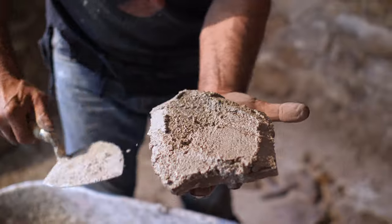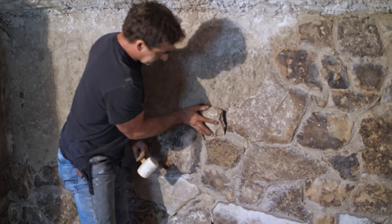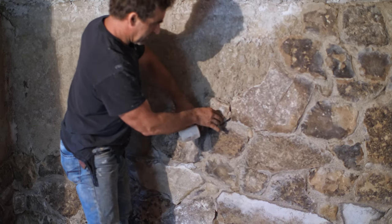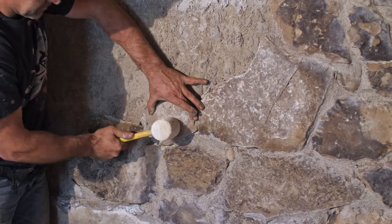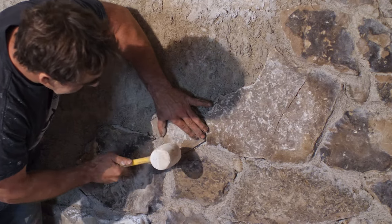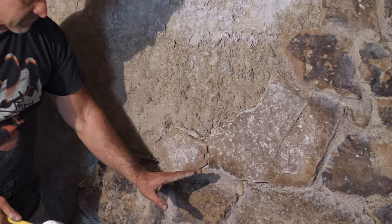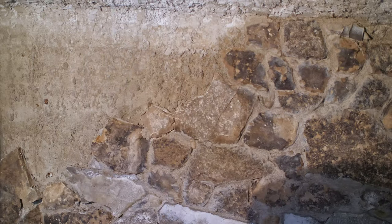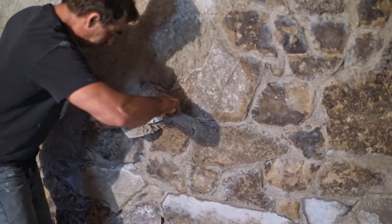In doing a lot of this now, I've come to realize with experience about what I need to put on. Get it on the wall there, and then with a rubber mallet just tap it into place and the mortar should start leaking out the sides. Usually I try to lift it a little bit so that I get fresh mortar coming out from there — that way I've got a mortar bed coming all the way through. As I go I just kind of roughly point or mortar it into position.